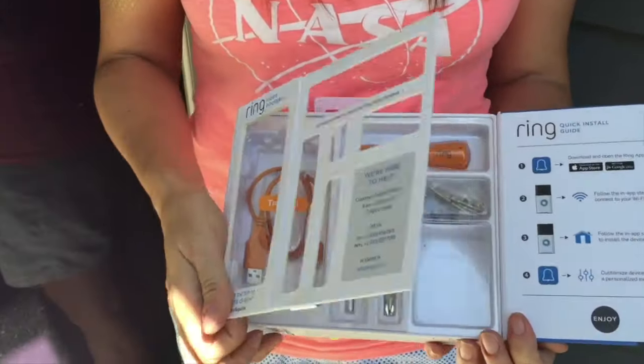If you're thinking, wiring — I'm not going to do that — the truth is you can do that. Doorbells usually use very low voltage wires and once you turn the power off at the breaker panel it's actually really easy to connect a new doorbell since it's almost always just two simple wires. Having installed several video doorbells in the past few years, I can definitely say this is not a hard job. You do need to know that your existing wiring is connected and functioning, so I'm going to assume you already have a working basic doorbell and that you've visited Ring's website to check if your existing setup and wiring is compatible with the product.